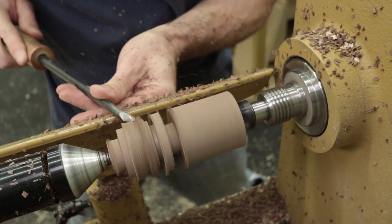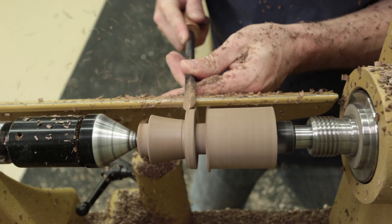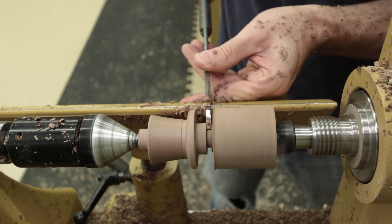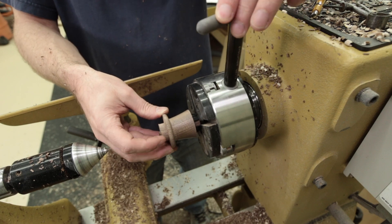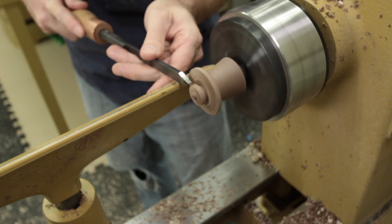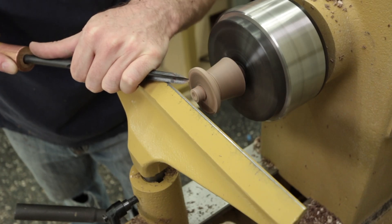The top of the hat is turned to connect the two reference cuts. I round the top of the brim to make it appear like it's slightly drooping. The tenon above the hat is turned down to about a half an inch — the exact size is not critical here. The hat is then parted off just below the bottom tenon. The tenon at the bottom of the hat will be used to attach it to the snowman. I drilled a half inch wide hole in the top of the snowman, so I need to turn this tenon down to a half inch. I use the hole in the snowman as a guide until I get a nice snug fit. The bottom of the brim is cupped out, which adds to the drooping look and allows the hat to sit flush with the snowman.